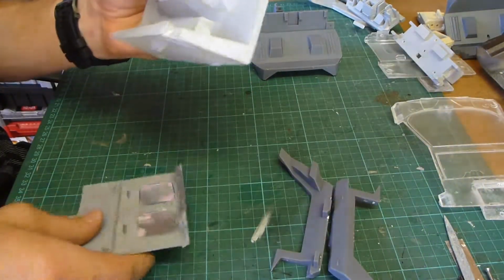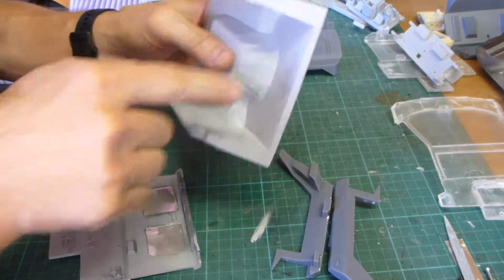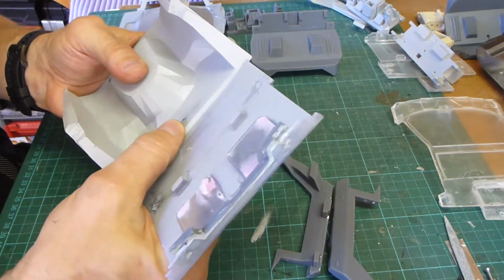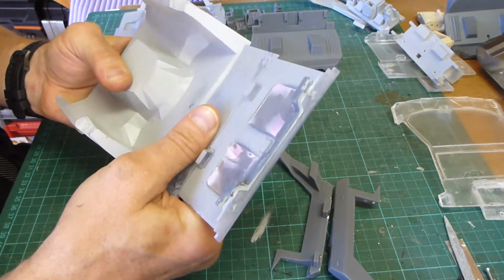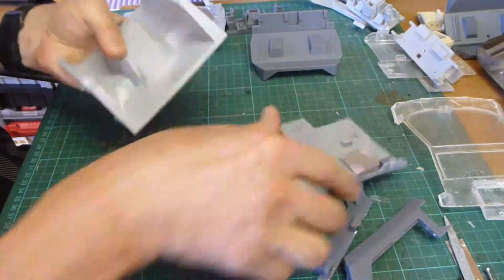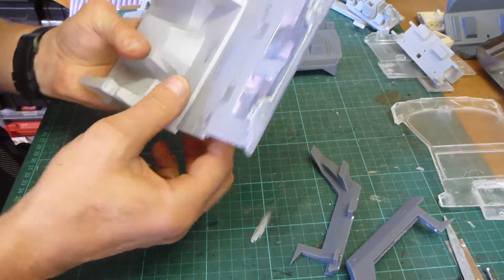What I did over here was, from this end halfway through, and then all the way through on this side. Sorry, I first lined them up and then went all the way through. So you can actually line it up. You can see the hole through the other end, because this is a clear bit. Drill it through and then tap it all the way through.